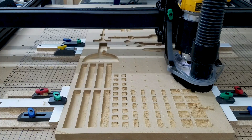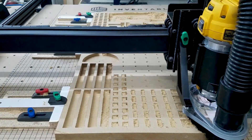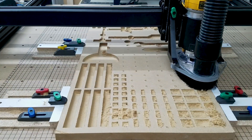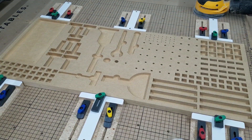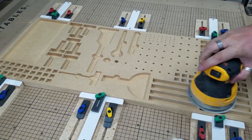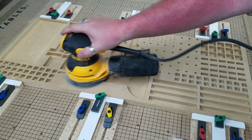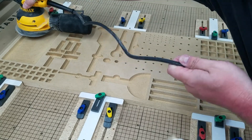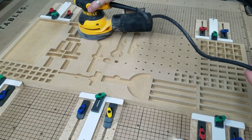As you can see, there's a lot of dust in those pockets — a lot of sawdust. You'll want to make sure that you're clearing out those pockets as best as possible in order for the dust shoe to collect all of the sawdust. Lastly, you're going to want to vacuum up all of the sawdust out of the pockets. Take a fine grit sand to your project to make sure there are no fuzzies anywhere, give it a nice clean wipe down, re-vacuum. And before you remove your clamps, it's always highly recommended to test fit your different bits and pieces that you're wanting to put into your work surface to ensure they fit.